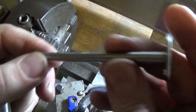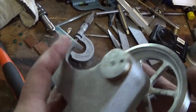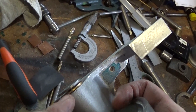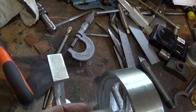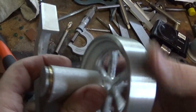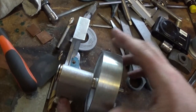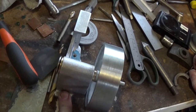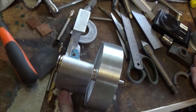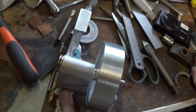So we've got the front of the crank and the back of the crank with the pin in it, and this end's been faced off nice. The only bit to do is to put it together. This still has an eccentric to go in here, which means this has to be sticking out a little bit further. The flywheel goes on that end. And that's what the crankshaft looks like. Thanks for watching guys and girls. Don't forget to like and subscribe and all that stuff - it's awesome to get comments. Be kind to each other. More soon.